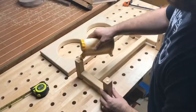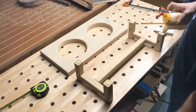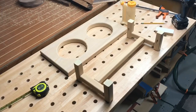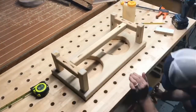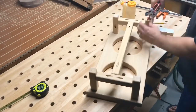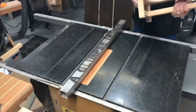To attach the top, the legs are end grain so I flood the surface with a little glue, wait a few minutes, then come back and flood them with more glue, which soaks into the end grain for a better hold. Once that glue dries up a little bit, I put one more coat on, make sure everything is lined up just right, clamp it in place, and put the screws to it. Couldn't be simpler.